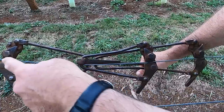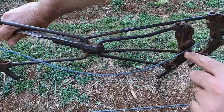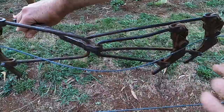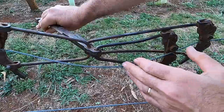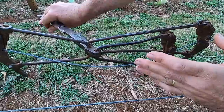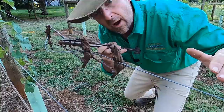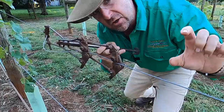There have always been a couple of inherent problems with these strainers. The first is that because they're so short, as soon as you start straining, it bends the wire out and actually pulls the wire out of the straining jaws — which means you have to cut the wire before you start straining. You can't have a loop of wire build up during the straining process. That's a bit of a safety issue because you've got bits of loose wire flapping around right near where you're operating, and if they let go you're going to have sharp objects whipping past you.